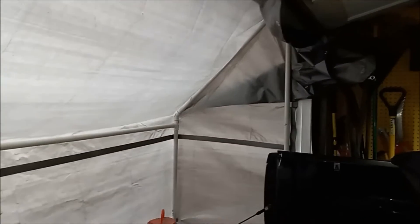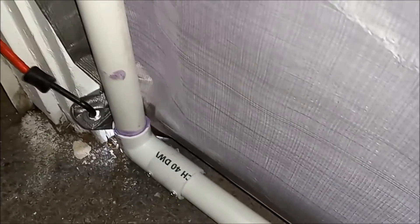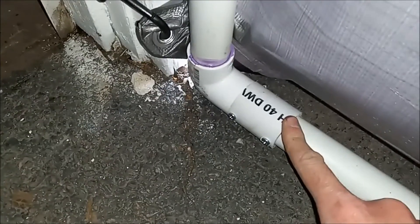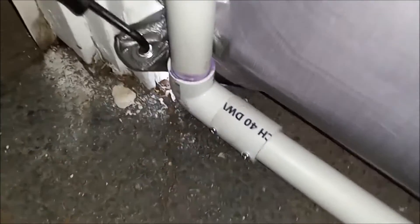When you're ready to take it down or just move it, you just undo the bungee cords — canopy comes down and the frame collapses. In full disclosure, I did have to shorten up the side frames about four inches or so to fit this tarp. I didn't have any couplers, so I found that inch-and-a-quarter pipe works pretty decently as a coupler. You can't glue it, so I ended up screwing it on both sides to shorten up the pipe. Running to the store was just way too much work, but the side frame is shortened and everything fits.